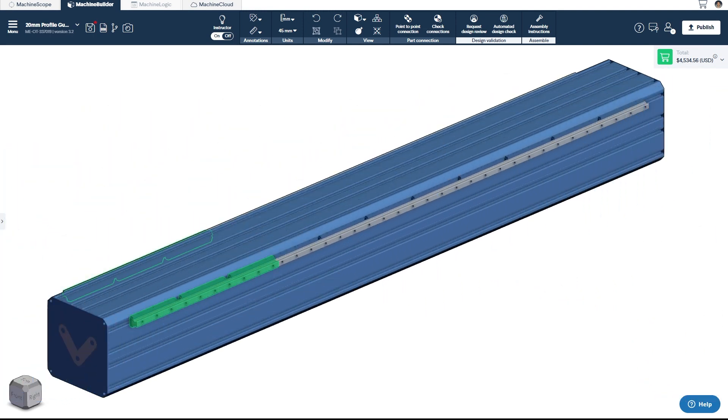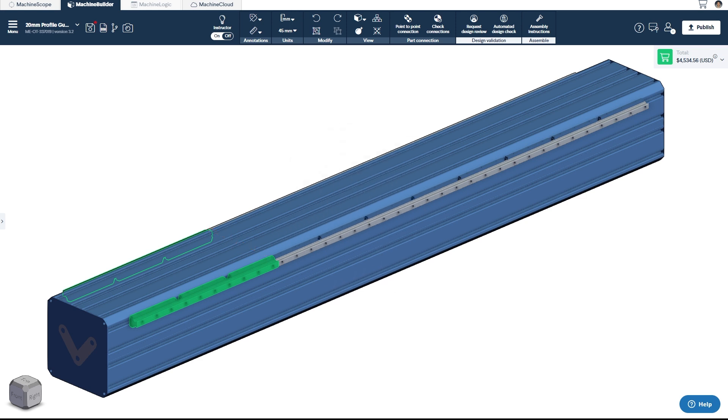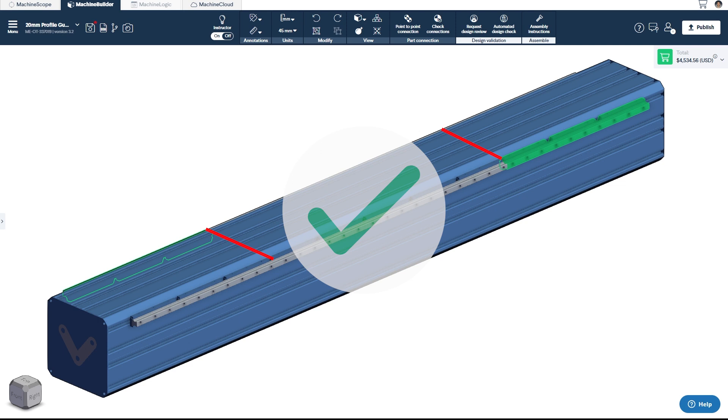Similarly, it is important to ensure that rails do not have joints at the same location along their axis. Hitting two joints at the same time will have a much higher internal stress in the bearings than only one side passing over and then the other side passing over afterwards. So make sure that these joints are offset, similar to how we lay bricks for a building.